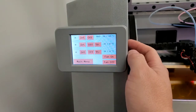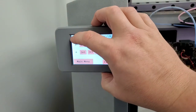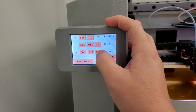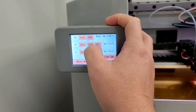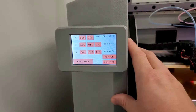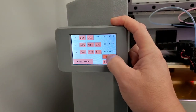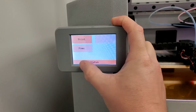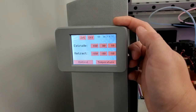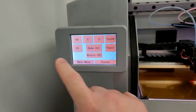Temperature — from here you can set the temperatures of the nozzles and the bed. You can click on the blank space and set it up for PLA, hit OK, and lock that in. Now your bed is warming up to 60 degrees Celsius. As it goes, you can print from there, and if you want to warm it up, you can turn the fans on or off. From here, if you select this, you can actually control that specific printer just from the temperature page.